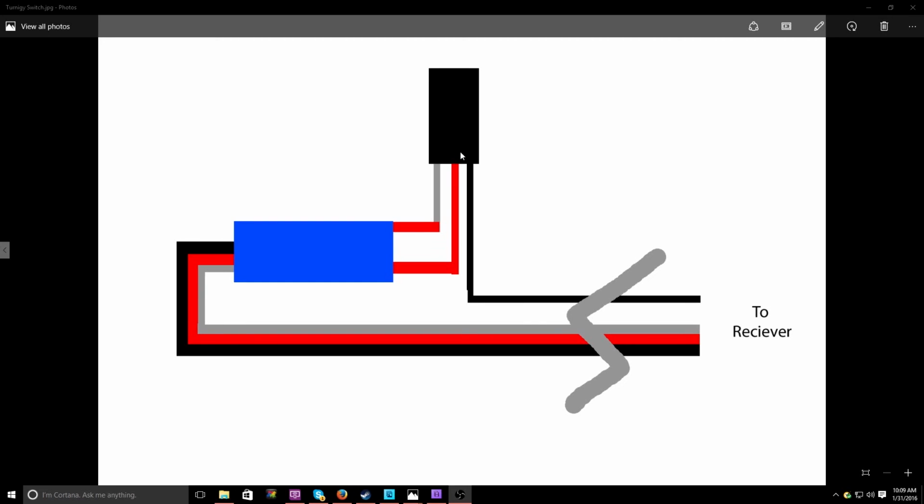So obviously right here, as you guys can see, I got the positive coming in from the connector. It goes in and it comes right back out, and it's connected to the white wire. Now in this setup, the white wire is being replaced with gray since I have the white background, but the white wire is being used for both as positive as well as the red one. But just remember that you have to watch how you connect up so you don't get an unintentional short,